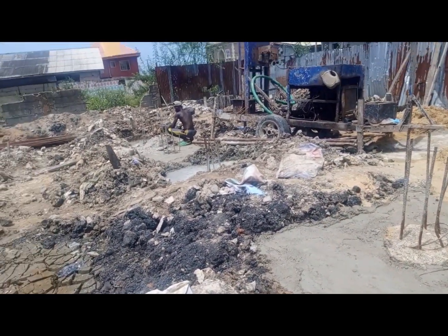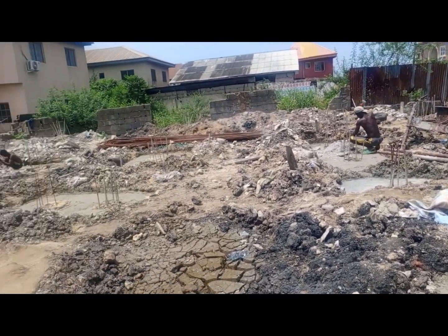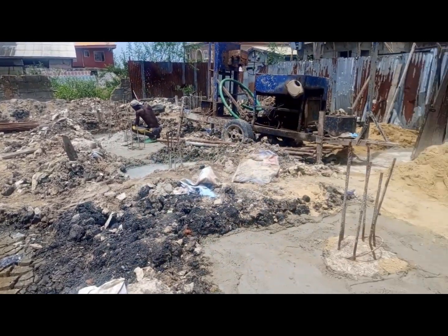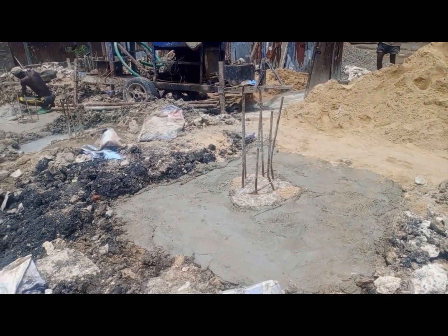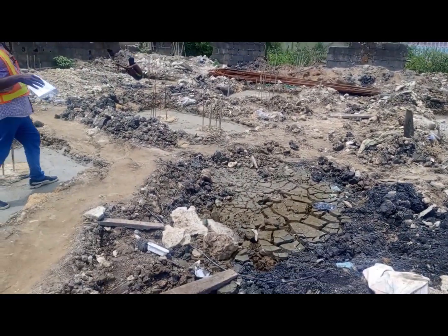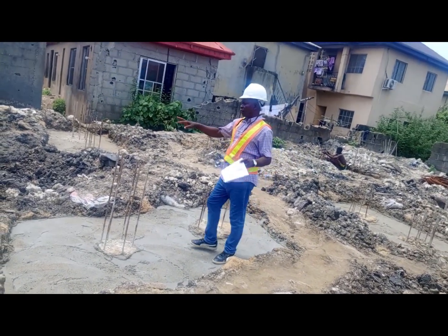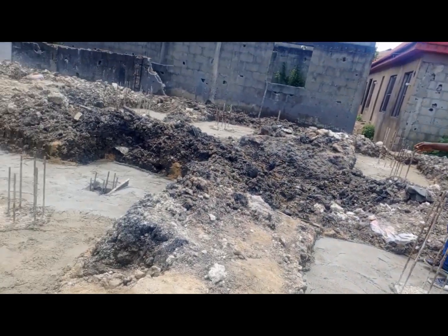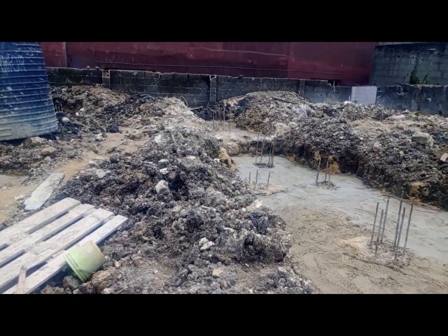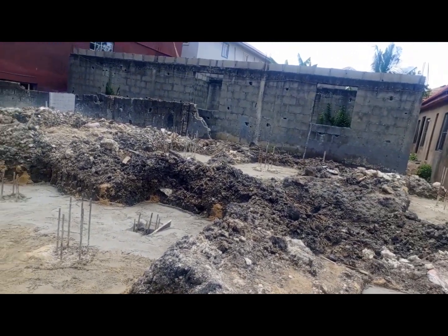We are breaking the pile head to remove any excess materials that are not concrete. It can be mud — you can see the terrain here is very muddy. Mud enters into the concrete during casting, especially at the top when you are trying to push out the concrete. Because the density of concrete is higher than the density of water, it displaces the water out, but with all this mud, the top of the pile will not be clean concrete — it will still be mixed with mud.